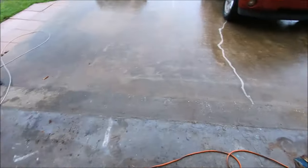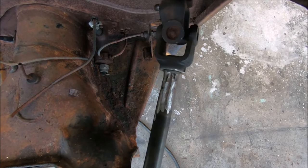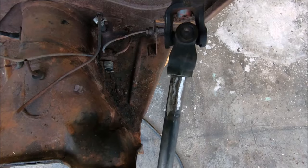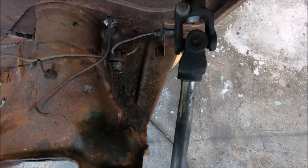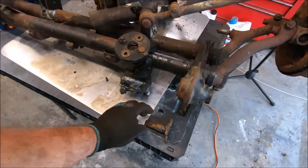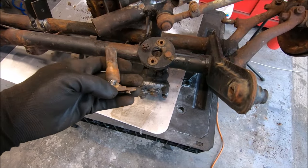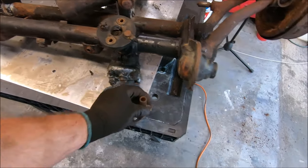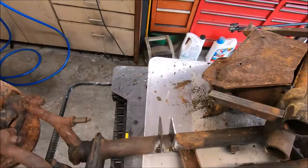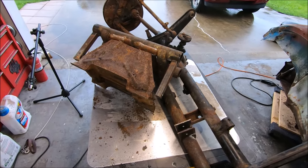Now, speaking of getting the stick to burn in really well, that thing's solid. I burn that thing in at like 120 amps. It'll be good. And we've also got the little steering adapter piece that I made to go from the steering box to that U-joint. We got to finish weld that, clean that up. So we got quite a bit. I won't bore you with everything. Probably just time lapse a little bit of it, and I'll bring you back in a little bit.